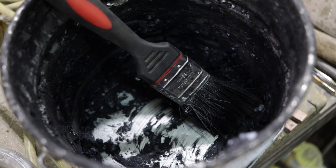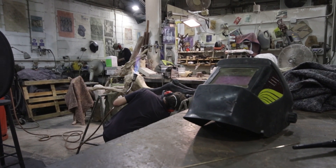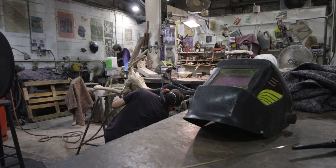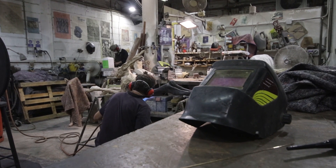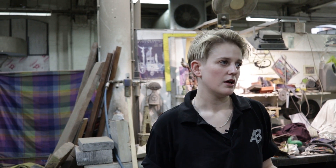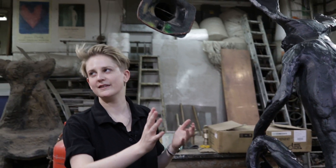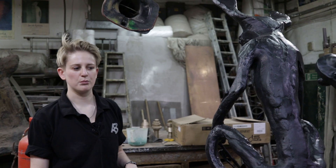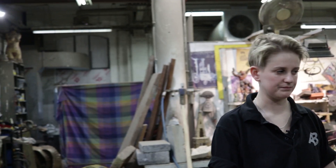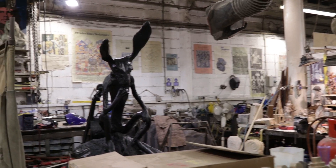Patination is the process of coloring the work. Barry's got a very specific patina that he likes — it's quite a greeny black, with a bit of a green base to it. We apply the chemical, which has been diluted in water, either with a paintbrush or by spraying it on, and you can accelerate the process through heat using a blowtorch. Once you've got to your desired colour and it's cooled off, you wax it to seal that colour in, and once waxed you can give it a buff which shines it up slightly and enhances that depth of colouring. This piece has been patinated and waxed already — it's pretty much ready to go. It's done.